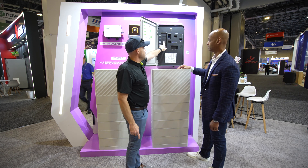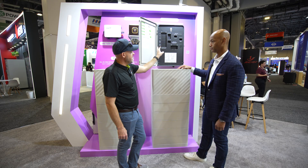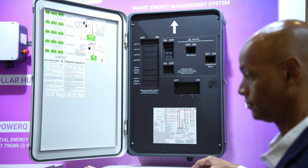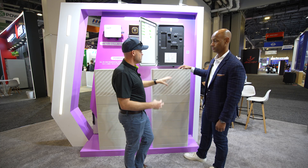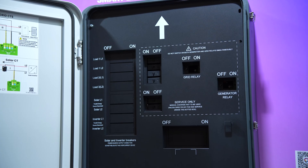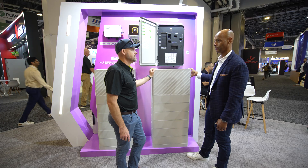The hub also has AC coupling and a DC coupling input for the Fox inverter. One of the things that's really unique is you have AC coupling and can also DC couple at the same time because of the hybrid inverter. You can AC couple up to 80 amps. If a customer has an old system and wants to add panels without matching old systems to new parts, you can DC couple the added system straight into the inverter. So if there's an existing micro-inverter system on the roof, we take the AC output landed here, and if we want more solar we can direct DC couple it right to the inverter.